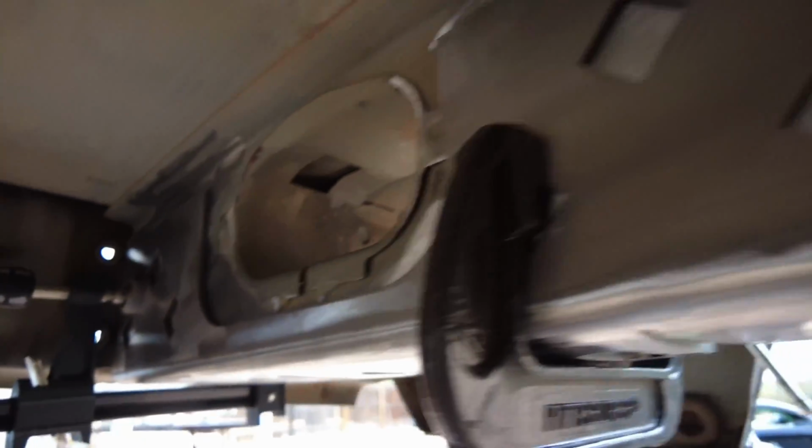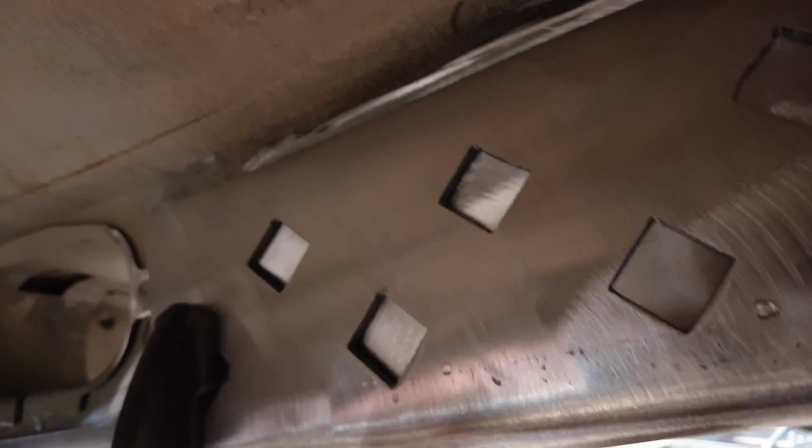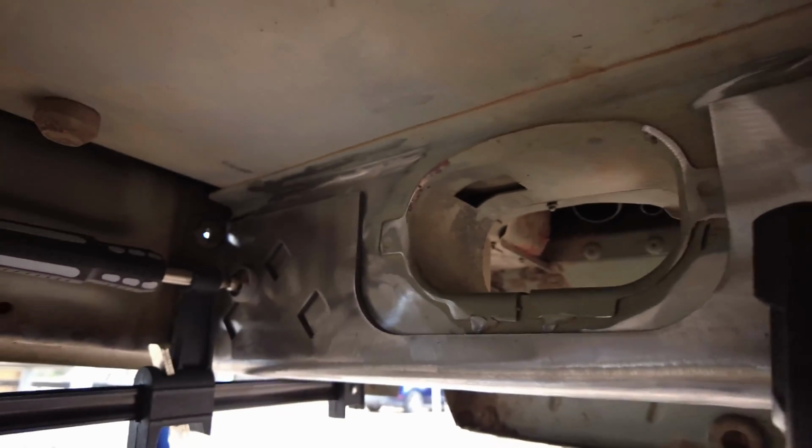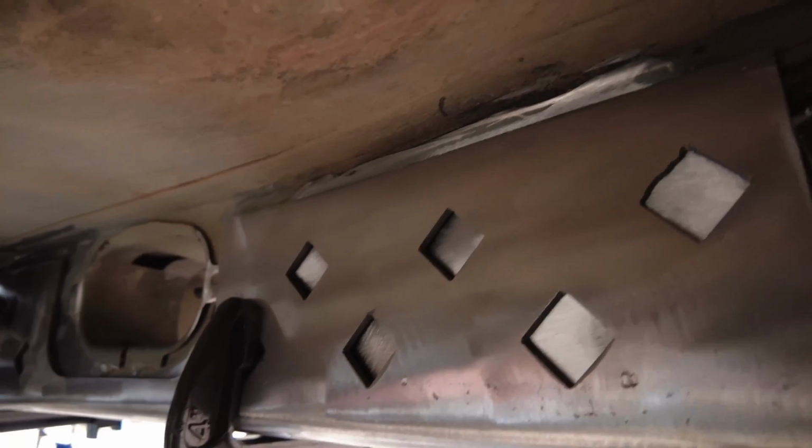So definitely use the relief cuts. I mean, I just used the relief cut with a clamp, and it pulled it right into place, nice and snug. On a majority of these, I'm going to use one more clamp right here just to pull it extremely tight to the unibody, and from there this entire side will be held on with 3 clamps, and it'll be extremely easy to get these welds.